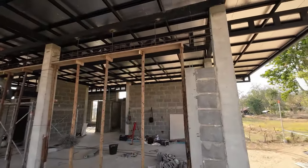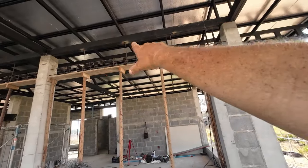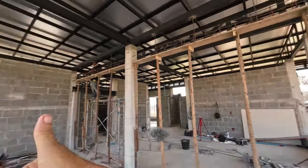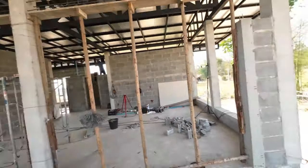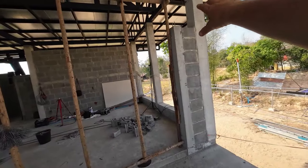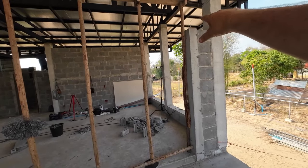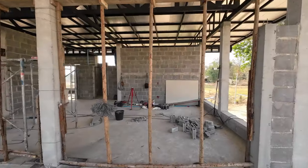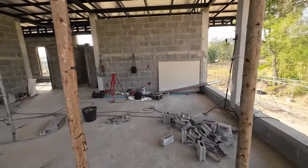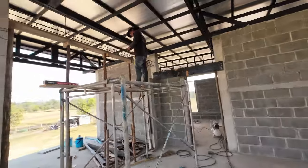So as you can see how they're doing the reinforcement. So that's going to be 30 centimetre high. You see how they're welded in. Good job! Yeah, good, good, good. So this one is, the window is 2.5 metres. Then you've got a 40 centimetre window along the top, and on the window. So that is, you've got like 250 for that.